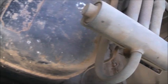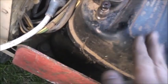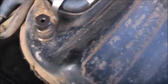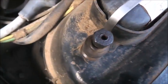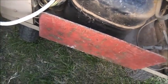R152a works great in cars, so let's see how well it works in a system like this. There's a reverse cycle too, so it'll be a good experiment. Good old Tecumseh compressor. Nice and solid. Full load amps is 8 amps, fully loaded. I'll note that because we'll do some tests with R152a. I'm betting it would use half that power.